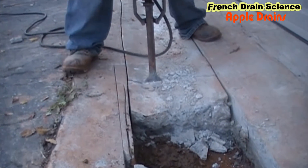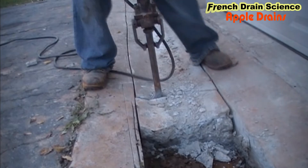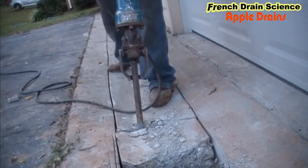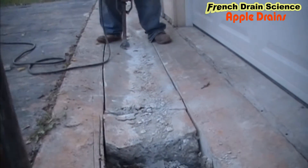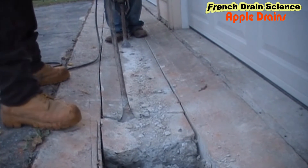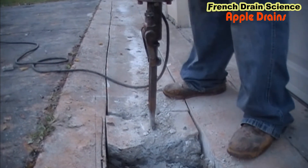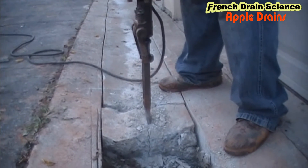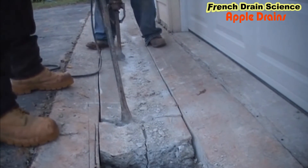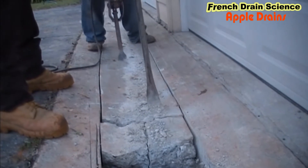It's just starting to crack, but because it's so thick we're going to have to crack it in half and get our pry bar to pop it out. We have to continue this the remaining 22 to 23 feet back across the drive. We're going to try to pop that piece out, but it's not going to come out — we'll have to re-crack it because the concrete is about six inches thick and the partner saw did not cut all the way through. We haul all the concrete away to the dump, clean up the area, and then start setting our channel drain.